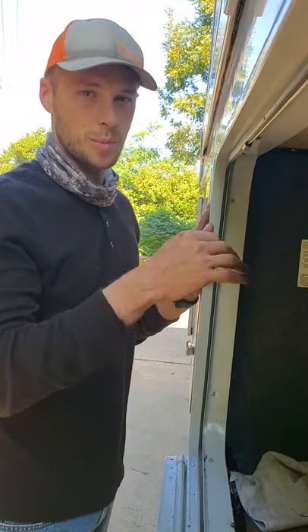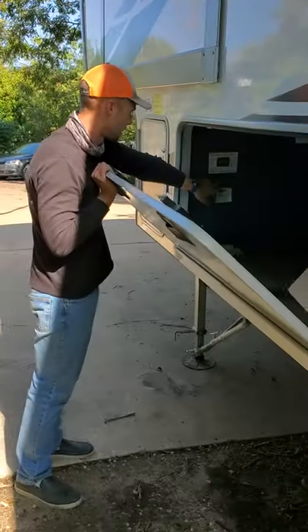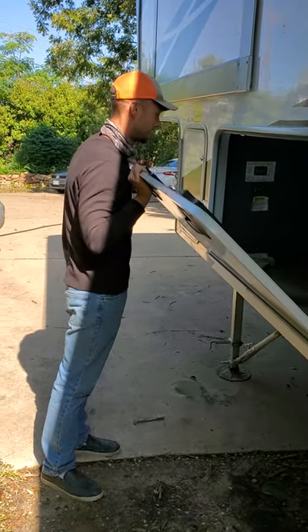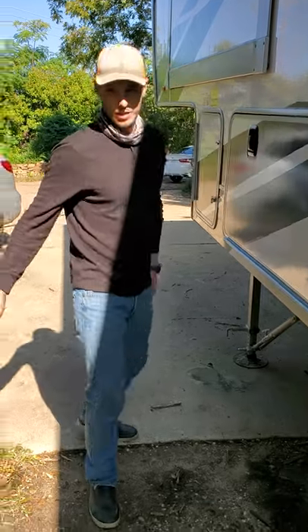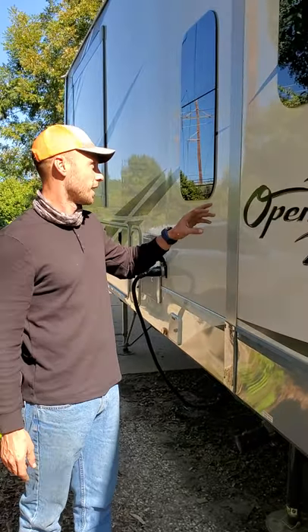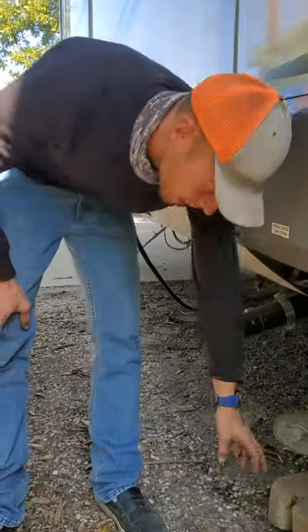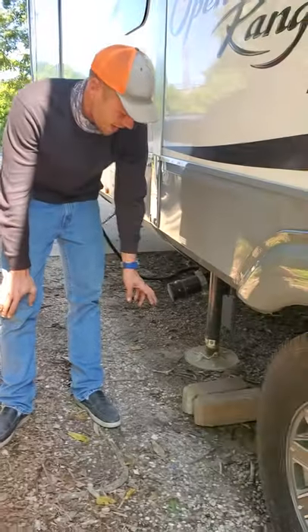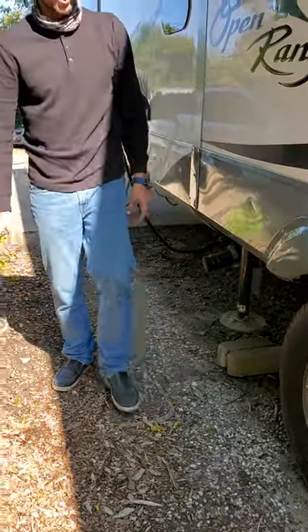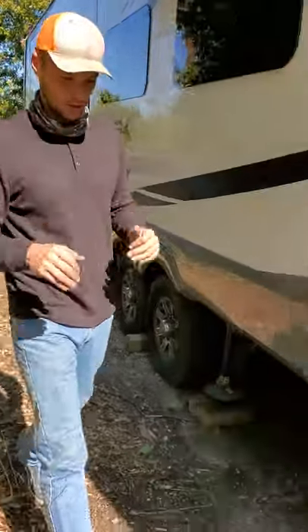If it's not a very level piece of property, some of these jacks might go out of stroke, so we kind of tried to prepare for that. Our piece of property slopes, so one of the biggest faults you'll get is 'out of stroke.' Out of stroke means the jack has traveled too far down and doesn't have any more room to travel. So we put these bricks under it to compensate — we did this on the back too, but not on the front, because the front's going to have to go down a long way.